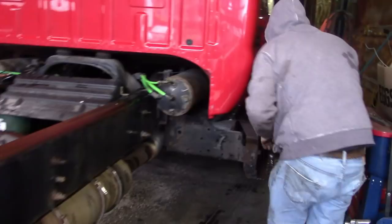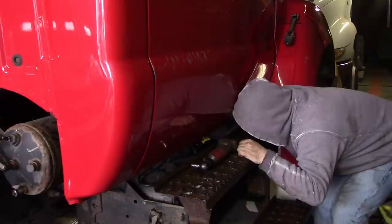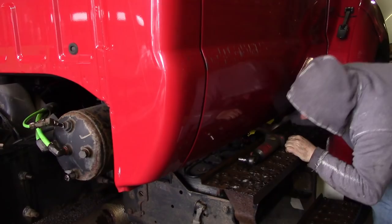Here I'm going to disconnect the batteries. I'm going to use a plasma cutter to do most of the cutting on this, so I like to disconnect the battery negatives and then take the negative off of each battery themselves, so there's no chance of messing something up if the ground had to touch again.